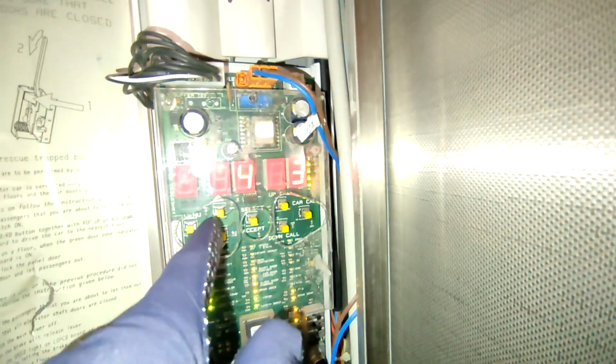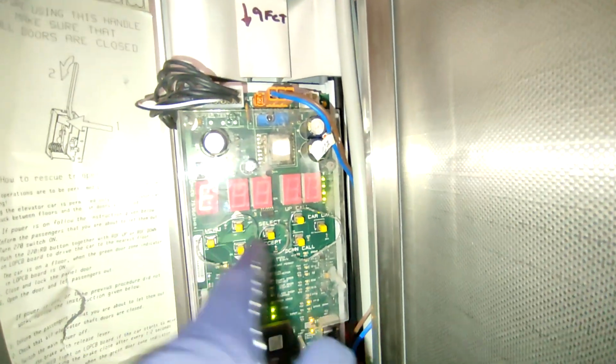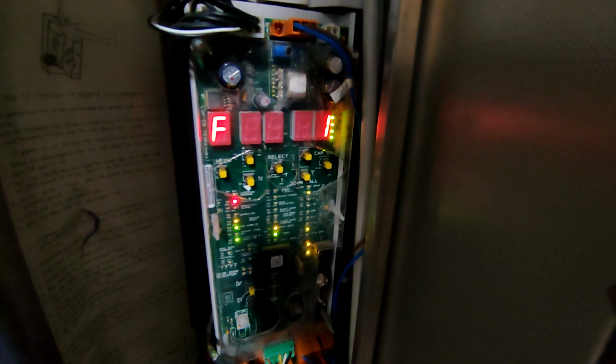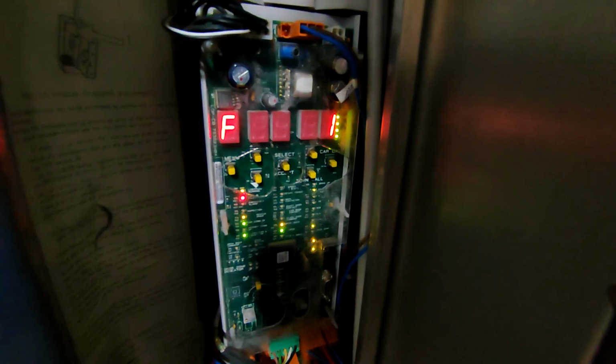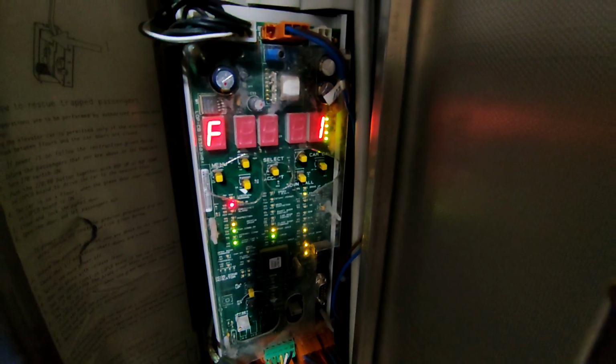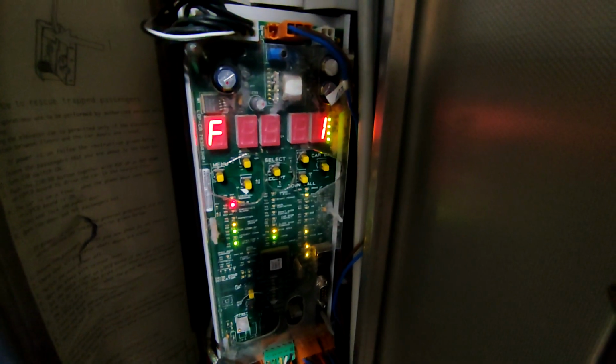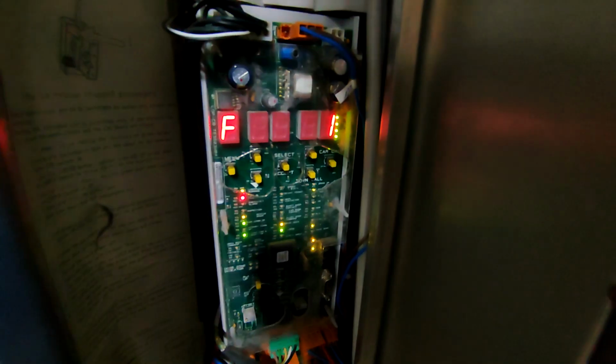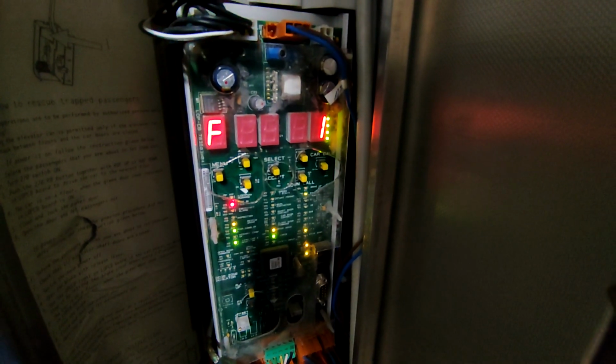So then, to see what's going on here, we need to take a look at the error log. Now on LC Logic, there's actually two different logs of faults. There are the faults shown as F, and these immediately show up on screen. Even when you're doing something else on screen, it immediately lights up with these faults as they come in. So the F faults will show F and the number showing how many faults. This is the current active faults in play.